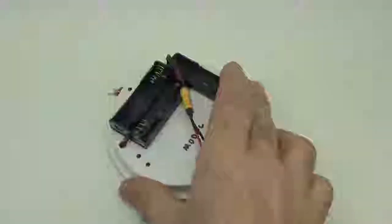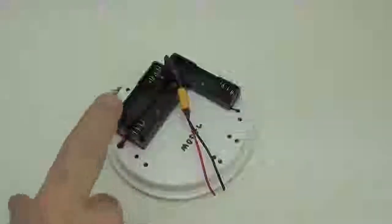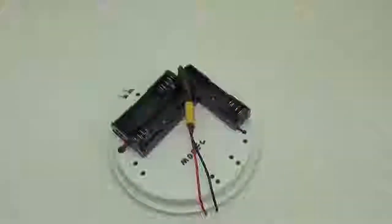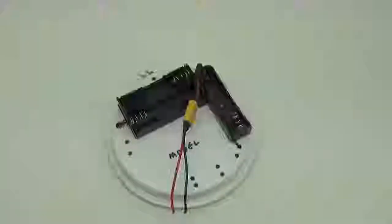It depends really on what power optimization you did when you were building the logger itself. Like I said, most people are getting around 0.25 to 0.5 milliamp on their first builds, and you just divide that into the amp hours of your batteries. AAs are about 2,000 milliamp hours, so that would be about 4,000 hours on a 0.5 milliamp system. Okay, so